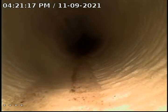This is an area where a lot of the sand was coming in. This is located underneath an addition — part of the sewer is actually under the addition. As we televised down through, you'll see a lot of the joints in the clay. There were a lot of offsets. The liner does kind of smooth that out a little bit, and it doesn't make the joint so aggressive with a flat spot on it.